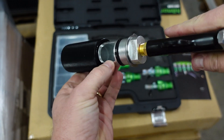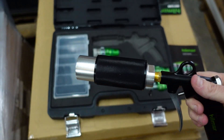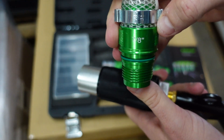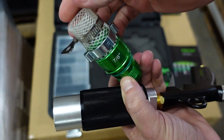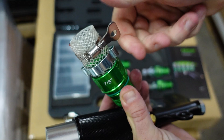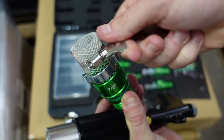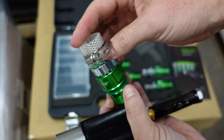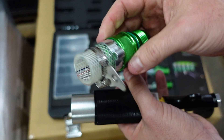That's where you insert the plug or pig — whatever you want to call it; pig is actually the technical name. Then you attach the appropriate size adapter — they're all clearly marked with the size of tubing that goes on it. They all have a constant tension clamp that attaches the flexible tubing to the actual adapter. Then it has a nice tension band that's got the thumb attachment on it to make it a little easier to tighten and loosen. If this were to ever break, fail, wear out, or strip, you could just use a standard band clamp from any hardware store or auto parts store.